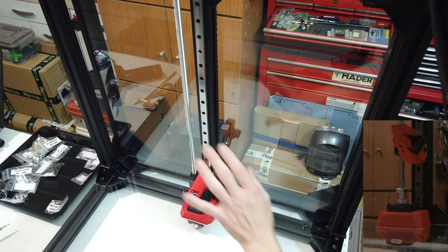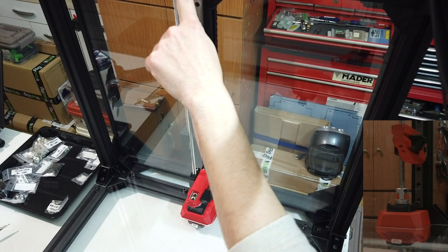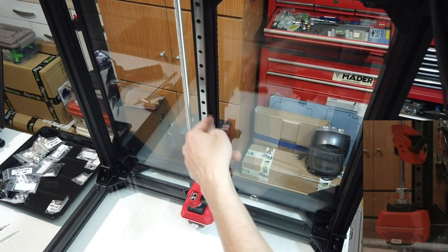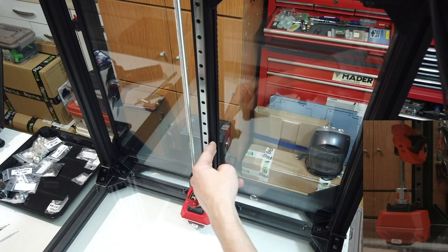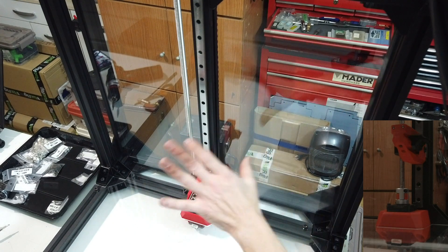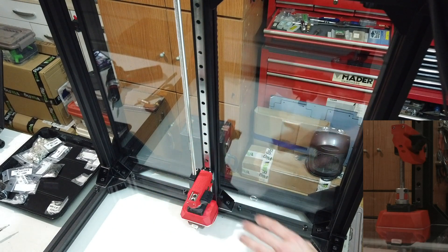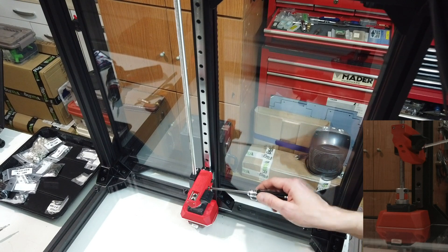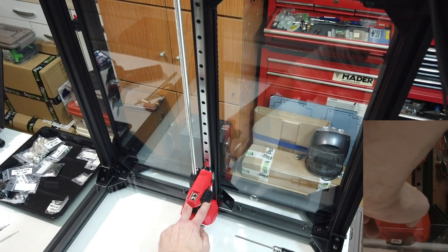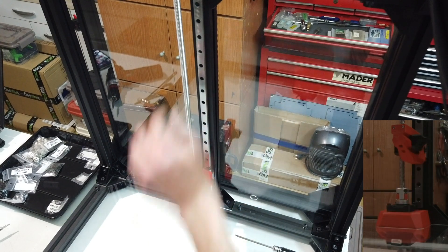I'm talking about the back screw right now. Starting with that, your lead screw should always be parallel with both the back extrusion and/or the linear rail. On Y direction we'll work in just a bit. So if everything is straight and your printed parts are correct, the first thing I do is to loosen the screws holding the anti-backlash nut and all four M3x18 holding the pillow block and the motor on the motor cage — so they are free to move.